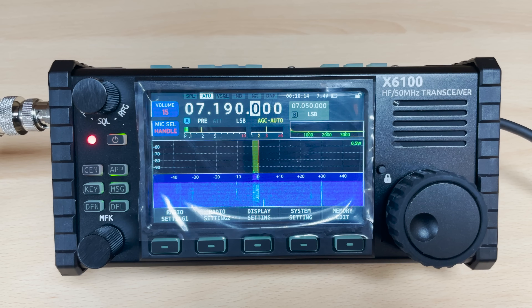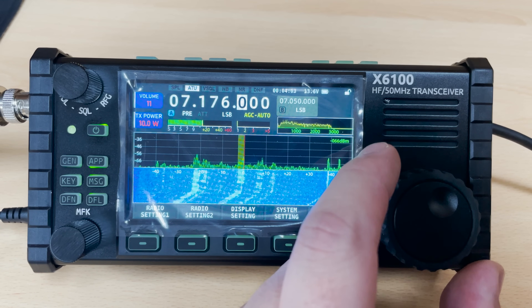Unfortunately my time with the 6100 was quite limited, but after looking through the menus I easily found where to adjust things like mic gain or power. Incidentally, when running on internal battery the radio doesn't let you adjust the power level above 5 watts, but when running from an external supply you can set this to 10. The screen is not touch screen so adjustments to menus must be done using the push buttons and rotary controls. However, I managed to work out how to change the settings without even looking at the manual.